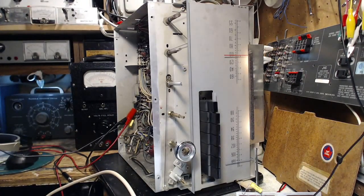Okay, that's lots of listening. On the FM side, you get things tuned, put a strong antenna on it, turn down the treble a little bit because the treble seemed to boost on this receiver, get a little bit shrill, and once you have it set, sounds pretty good. Sounded really quite good. AM, hard to tell because if you're listening to someone talk, it's a little hard to tell. But that last station really didn't sound quite right to me.